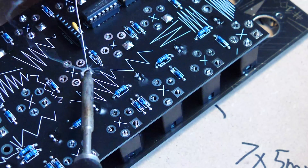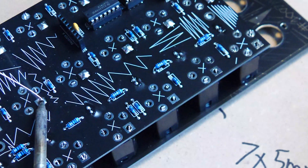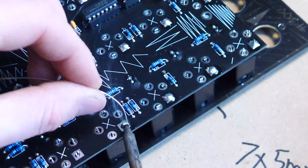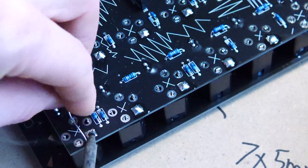Put the panel on and bolt it all in — still without soldering. This ensures everything is perfectly lined up, because if sockets are slightly bent before soldering you could damage the circuit board. Now solder it all down. Only the ground and signal points on the jack socket need soldering, though you can solder all points if you prefer.